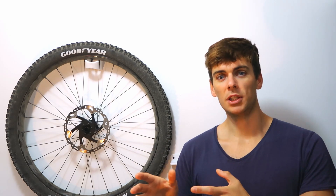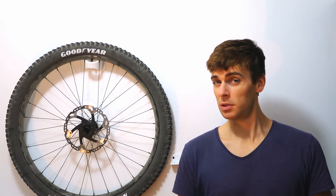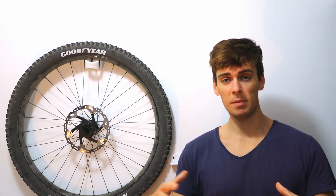We've got two different design philosophies with the bow. We've got wave-piercing shapes — a lot sharper, as seen in previous generations of IMOCA boats — and we've got more voluminous, buoyant bow shapes with a lot more beam towards the front. We're starting to see the latter more, and one boat in particular — the L'Occitane boat — has a very buoyant bow shape with a lot of beam up front, favoring buoyancy over ultimate wave-piercing.